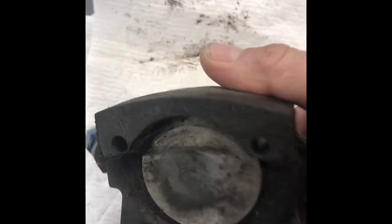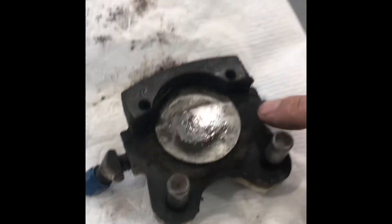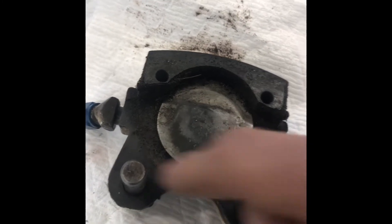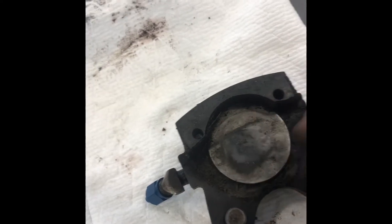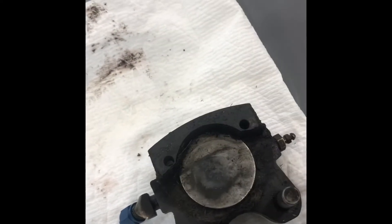Here's the brake caliper. We've done a brief inspection looking for cracks and things that may have caused the leaking at the puck. This aircraft operates out of a grass strip, so there's constantly grass and stuff caught in the caliper. When the caliper actuates, the puck comes out and exposes its side, and all that grass and crud gets stuck in there. When the caliper retracts from vibrations, it pulls that grit in — which probably scored and nicked the o-ring inside. We'll clean this up in the solvent tank and pop the puck out using compressed air in the fitting.